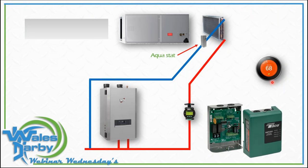So we had the common system, the pump, the aquastat, and the hydro air control. Can we make this more efficient? The answer is yes. This Taco VT pump — probably one of my favorite pumps and probably the best application for it is hydro air, and we don't see it being used for that. If we get rid of that aquastat — this pump comes with two sensors in a box. Typically those sensors go on our supply and return pipe. We monitor a delta T. This is a VT pump, a delta T pump.